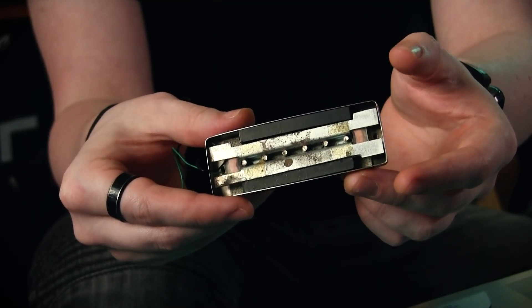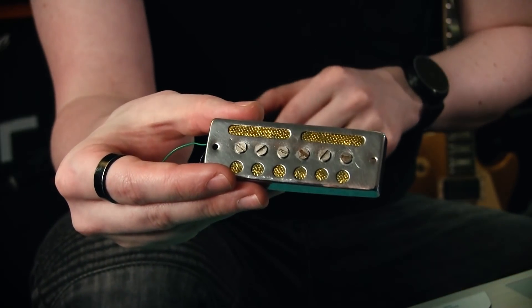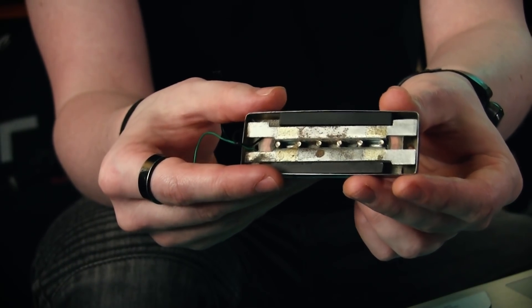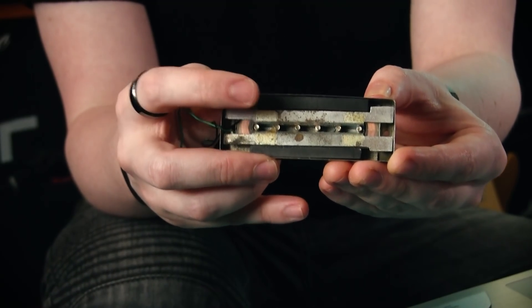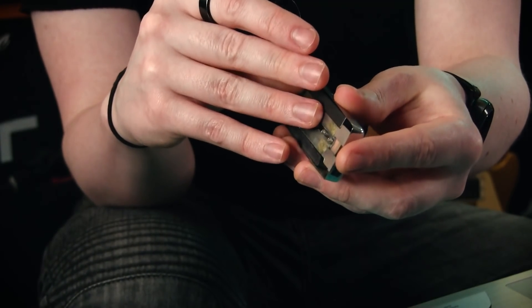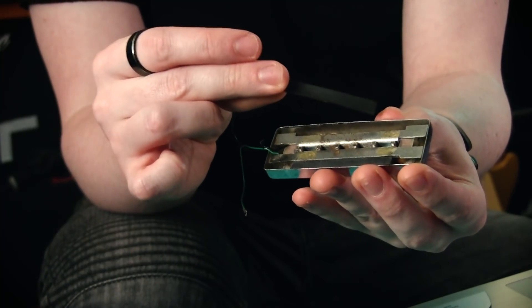The gold foil itself appears to be some sort of cloth or fabric material with a gold layer on the front. In gold foils this can be made from a bunch of different materials - you'll often see it on card or paper, or sometimes as a thin anodised aluminium sheet with a gold anodisation, but in this case we've definitely got cloth or fabric. Most pivotally, we have two ceramic bar magnets on either side of the coil and they aren't attached very firmly at all - these can very readily just be pulled out, and I think that may be where our issue lies.